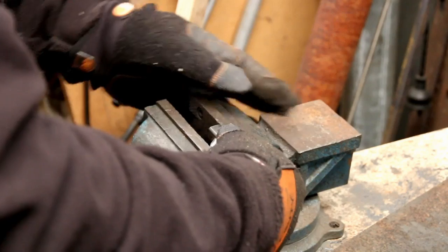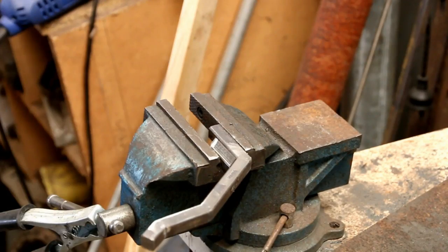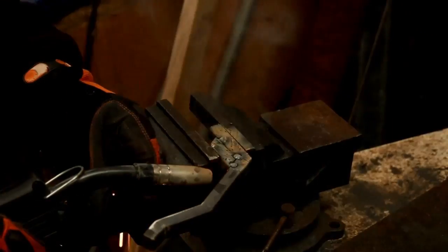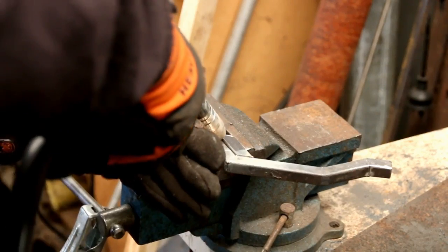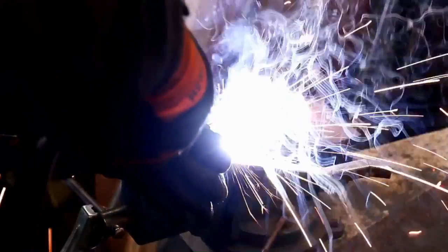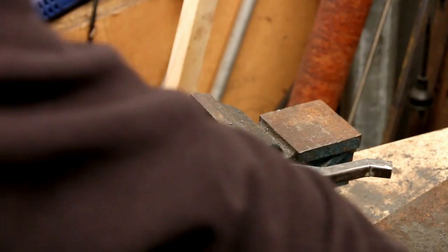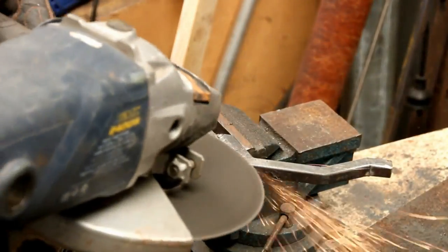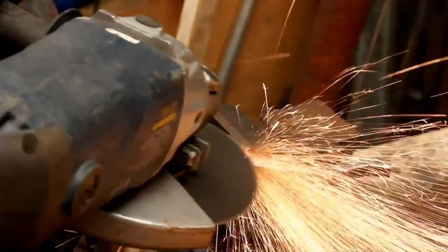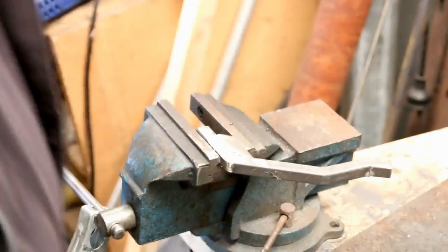In this case it'll be a 12mm hole, or half inch. So what we need to do is weld that piece in close — weld the sides, weld the top, and weld the other end as well. Weld both sides and make sure you've got a nice penetrating weld. Clean it off and grind it all flat. You need to make sure that all the welds are ground off so they have a nice flat surface.